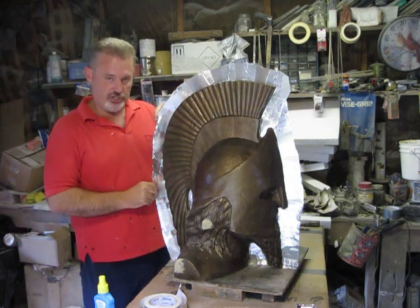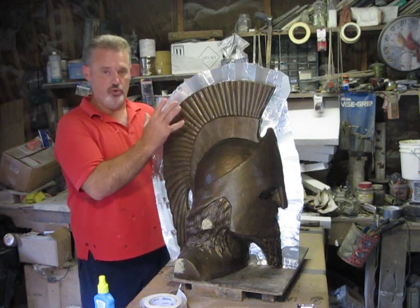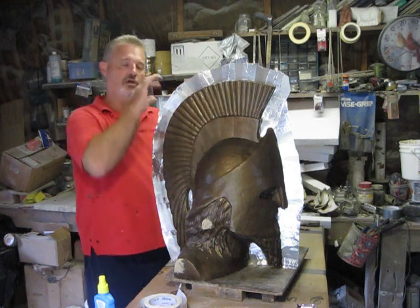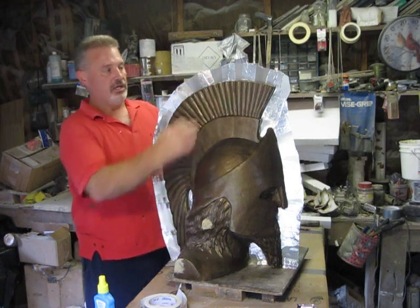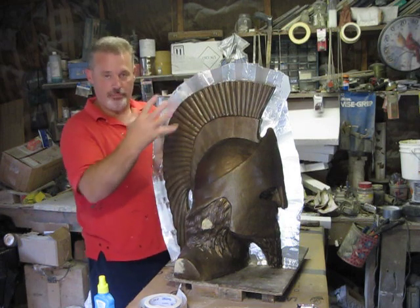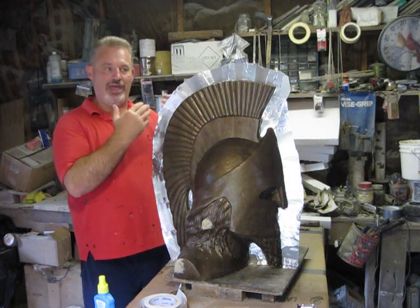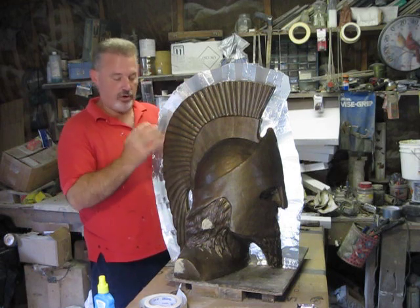It creates a really, really sturdy seam line so that you can do a mold in what they call a matrix mold. And you can do it without doing one side and then having to go to the other side — you can actually apply all the rubber at one time, and then the outer shell can be applied. When you pop this apart and pull all this out, because it's so thin, it's not going to create any gap within the mother mold material, and the rubber part closes up anyhow.